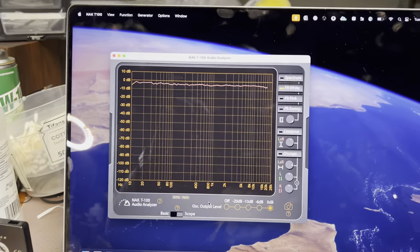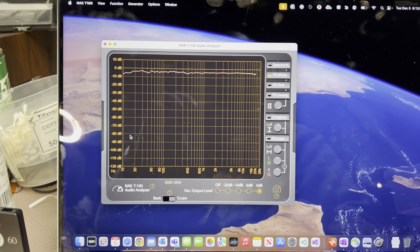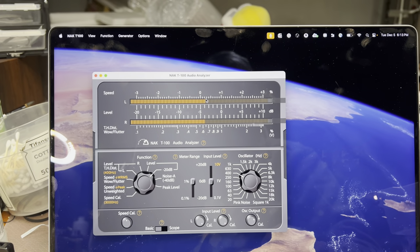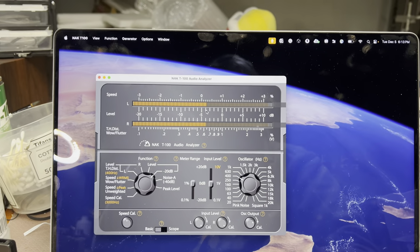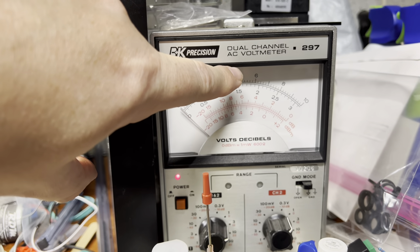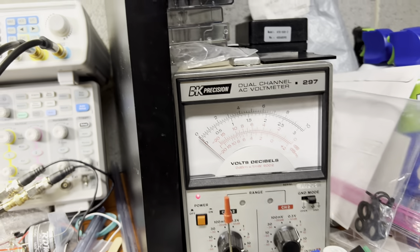And we see that it deviates from zero. However, our Nakamichi deck is tuned for 500 millivolt output, and that's where we have minus 4 dB. If you see here, 500 mV will be right in the middle — on the top scale it will show approximately minus 4 dB on the lower scale.